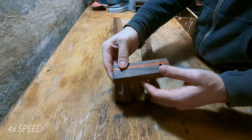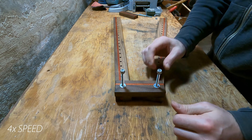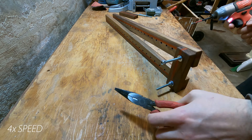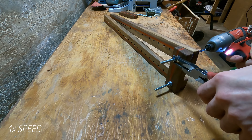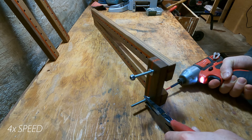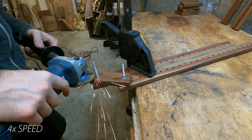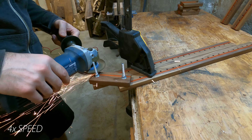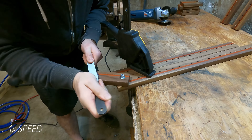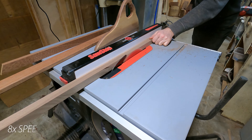Time to slap it together. These are just quarter-20 Phillips pan head screws with a nylock nut on the other side to keep everything snugged up. You don't need to crank these down — you still want the jig to have a little movement in the arms to match the size to each frame. The screws are about three to four inches long — just get them long enough and cut off the excess with an angle grinder or hacksaw, then use a file to smooth out the top of each screw so you don't cut yourself while using the jig.